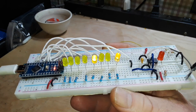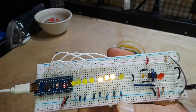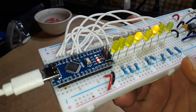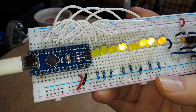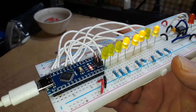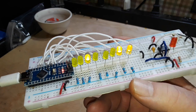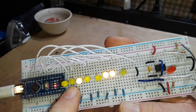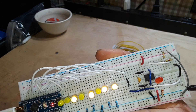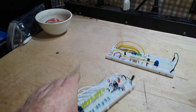As I'm running this program I'm noticing I'm getting a bit that's not lighting, and I'm thinking: does my super cheap Arduino Nano knockoff have a bad pin or a bad joint or something? So I figured I'd do some sort of little experiment and see if I could access the different pins. This is the one that seems to not be working and it is attached to pin number D3, so I'll take that off and pop this off the board.